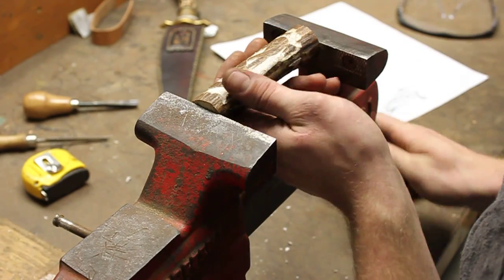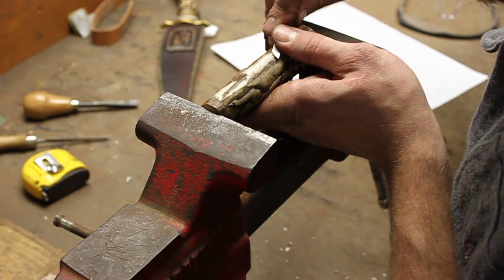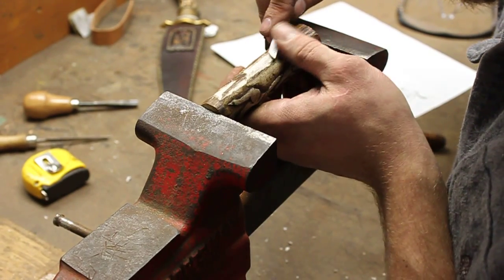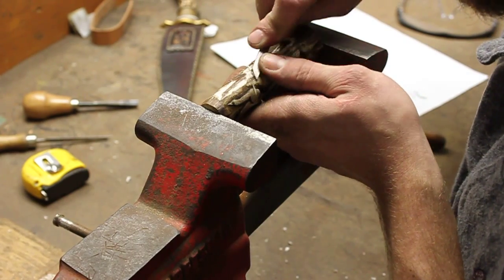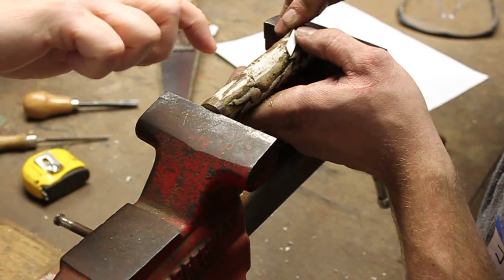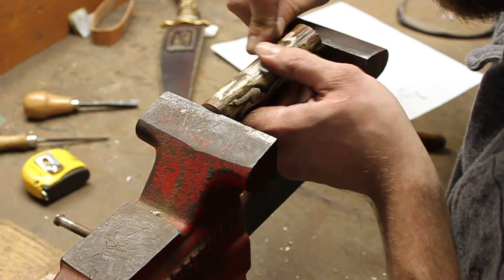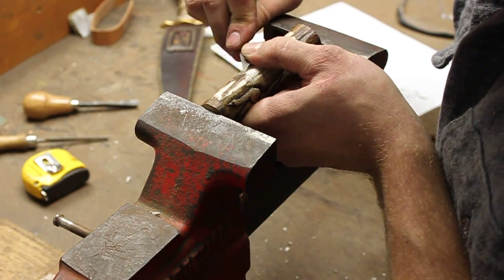I do wood carving, and one of the tools that I really like that most people don't use is scrapers. You ever see cabinet scrapers? Yeah, I've made a few bows, and there's a lot of scraping. Right. So I have a whole series of little tiny scrapers. I buy W1 tool steel stock, it's super cheap. You buy it like 1/16 by a quarter, bend it over, harden it with your propane torch, and then grind it. You can go in there, and it's faster, more precise, and there's no danger of skipping off. You just scrape it down and get incredibly smooth finishes, all inside the little things.